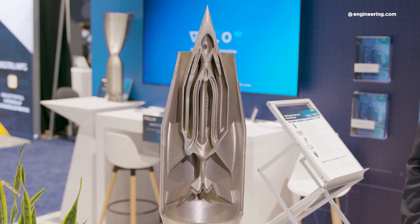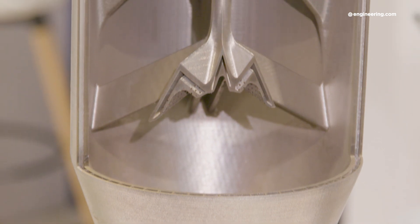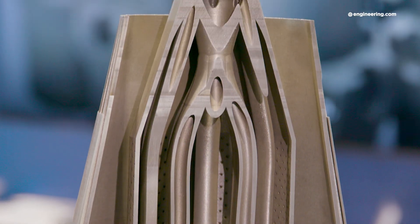So what you're doing is you're sending fuel up to the tip of the spike and you're essentially evacuating a lot of that aerodynamic heating that's happening as the oblique shock waves are set off, and you're rerouting that heated fuel and injecting it perpendicularly into the incoming airflow.